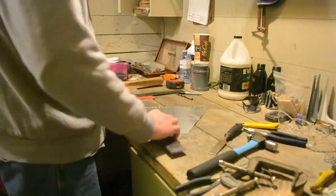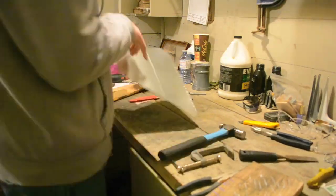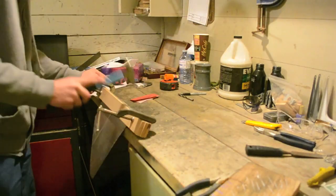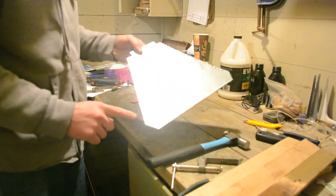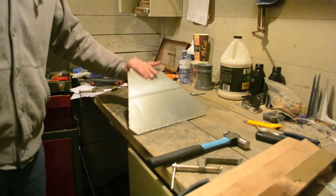On the side panels, you want to bend the front edge to one face and the other 3 edges to the opposite face. This will ensure that they are hidden later on in the oven. Here is the bottom, back, and top edge folded to the outside of the oven, and the front edge folded to the inside.